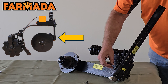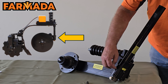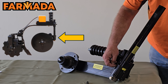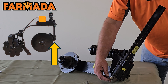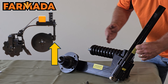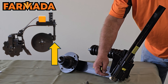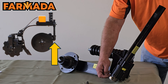Moving down on our collar, we have a grease zerk, and inside this collar there is a grease groove machined in to allow grease to get all the way around the collar and shaft. Down on the bottom we have a bolt through here with two high-strength rollers, and their purpose is as this goes through the field and rotates back and forth, it helps that to rotate and keep the bottom of the coupler from wearing out for long use.